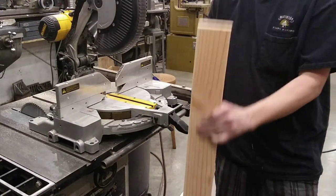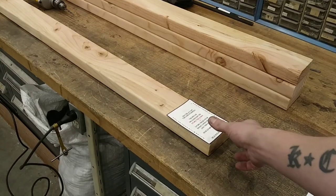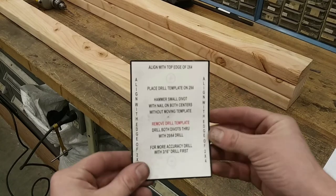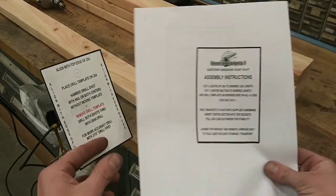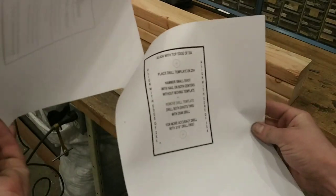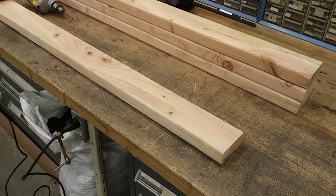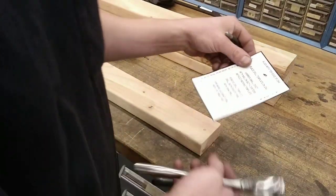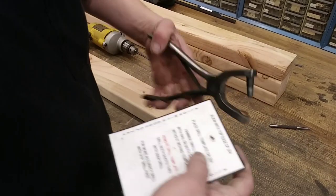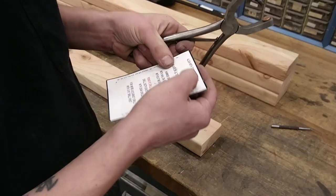The legs are ready to go, so now we can start drilling the pilot hole and then the actual hole that the carriage bolts go into. The drilling template they give you is made out of cardboard — once you drill through it there'll be an opening so it should work fine. I photocopied it just in case it gets wet or something. We're going to drill a 3/16th pilot hole and follow that up with a 25/64ths. You basically align the template on the top edge of the 2x4. I'm using a punch to get right in the middle.